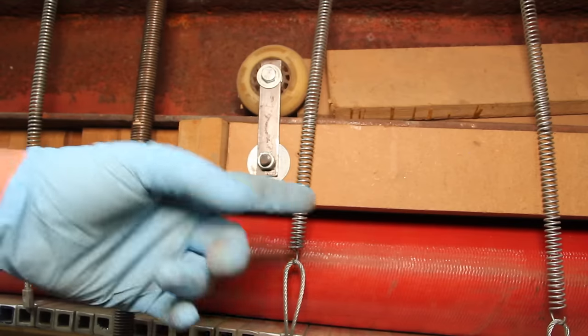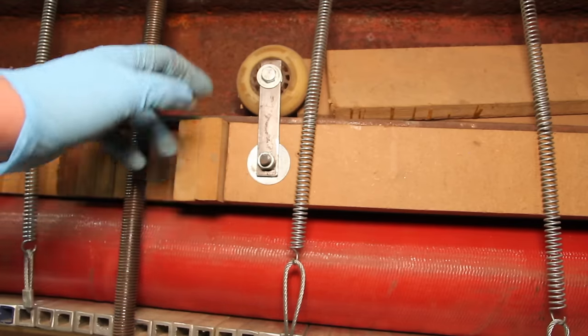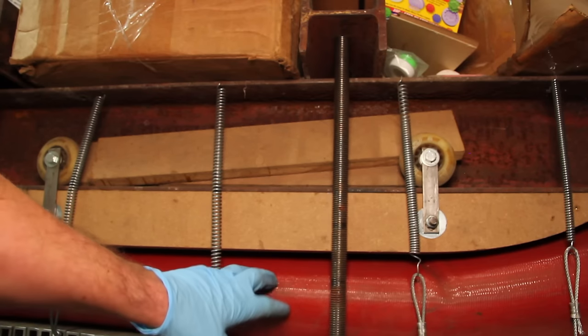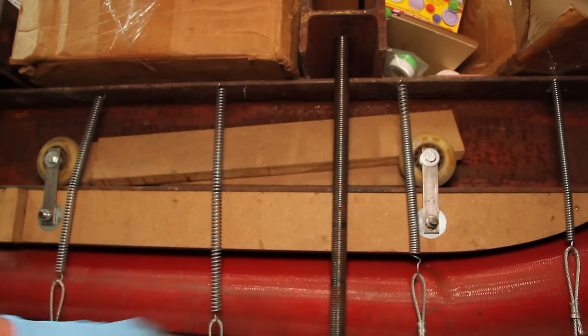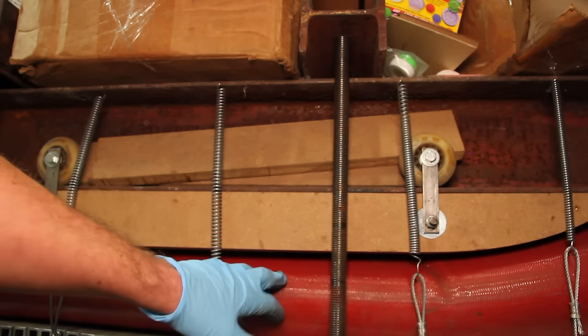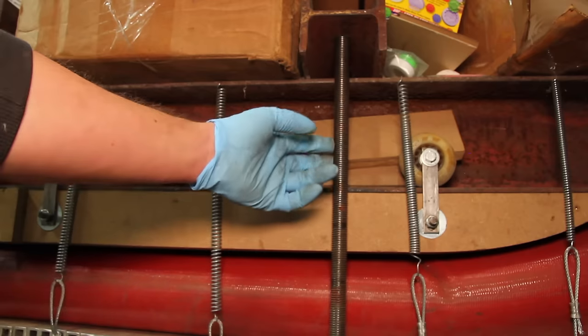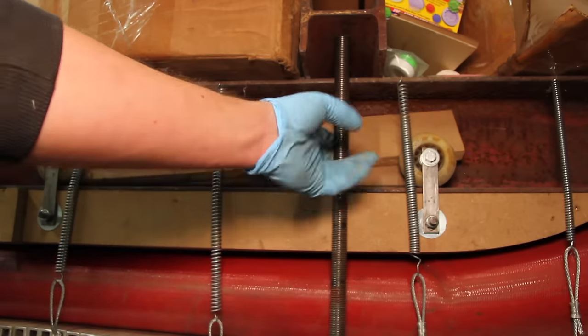The top mold here can adjust in and out, with some spacers here and just some recovered rollerblade wheels for that. I've got about 55 PSI in the bladders right now, but over this much area, that's a hell of a lot of force. So we have some deflection bars here that we put in after we load it. These are grade 7 threaded rod, so they're pretty strong.